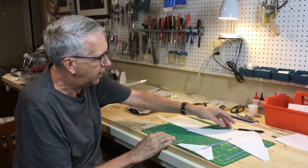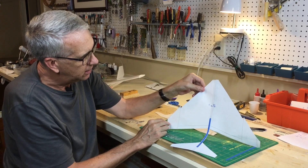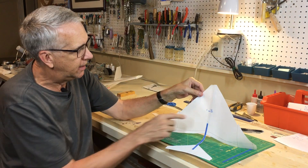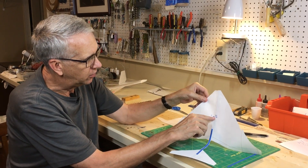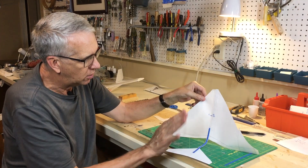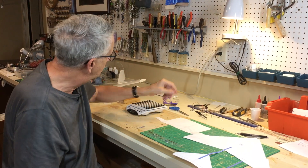Two last things I want to point out. With a swept wing design like this, the center of gravity is important. In the video for the design, I show exactly how to locate the center of gravity based on the mean aerodynamic chord. This will be the center of gravity for this model, which is a very important aspect.